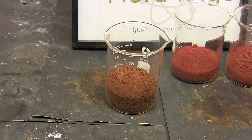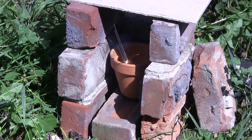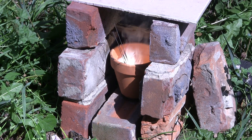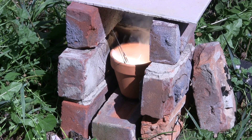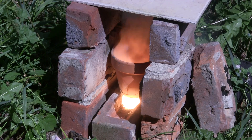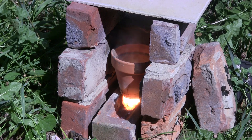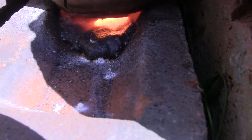Now we're going to try electrolytic iron oxide — 60g of iron oxide mixed with 20g of aluminum powder and lit with a magnesium-wrapped sparkler. Aluminum is the fuel of choice for thermite as it produces a lot of heat energy when it reacts with oxygen and it boils at a very high temperature of around 2500°C. By having a high boiling point it can reach high temperatures without mass being lost. Magnesium metal is also very energetic as a fuel but it has a boiling point of around 1000°C, so it can't reach a higher temperature without being lost to boiling. Looks like we're done — a nice complete reaction with most of the mixture drained out, and there is our pool of iron and slag.